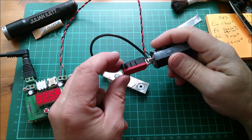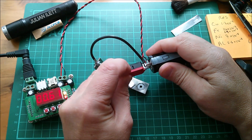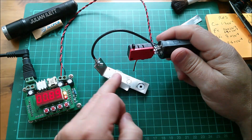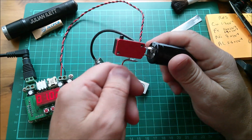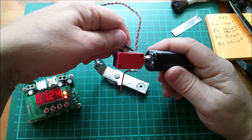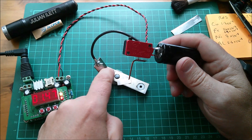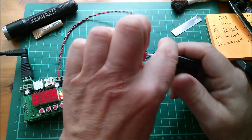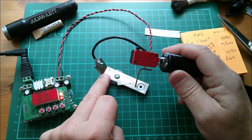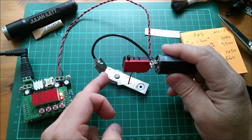Let's try that again. Press the point down onto the nickel, dump all the energy. That's not even melted anything. What's warm? That wire is moderately warm. Is the steel warm? No, not really warm — it's got a very large cross-sectional area, so despite its relatively high resistivity it has fairly good conduction. The switch doesn't get particularly warm, but the thing that seems to get warmest is this supercapacitor.